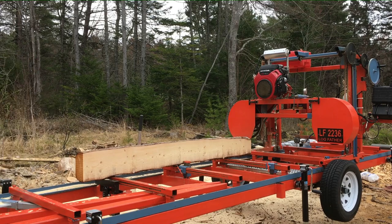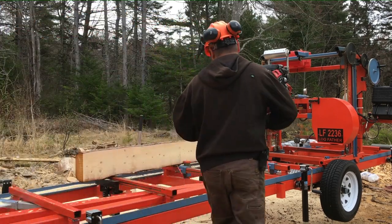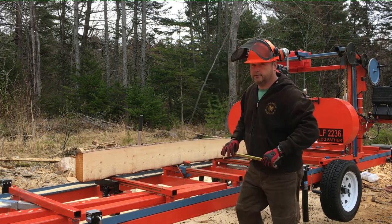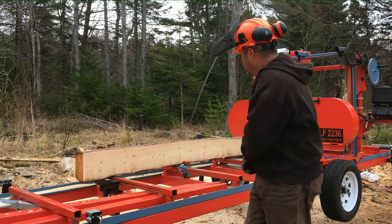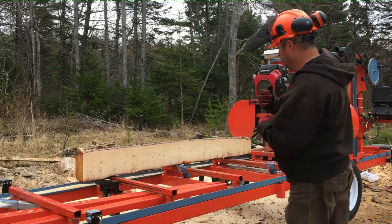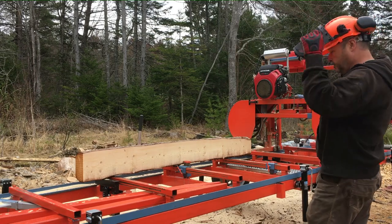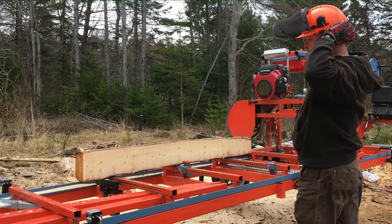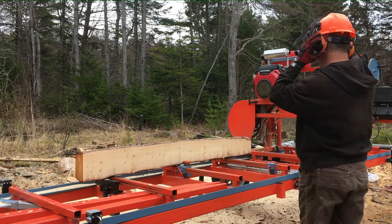That'll cut the top of that bark off. The other side, you can see this side here is a lot taller. So here we're up to almost 9 inches. So you'll see a lot of wood showing on that cut, but on the other side it's just on the cusp of the bark. So that's the only way I'm going to get that squared up without spending a lot of time to get a small piece of 1x2 or something out of that. Just not worth the trouble.